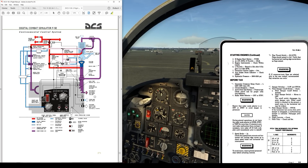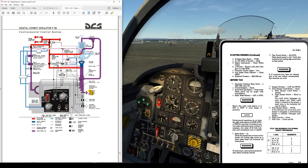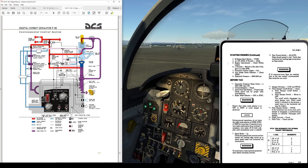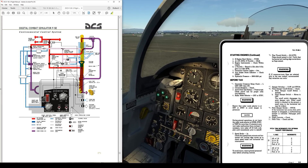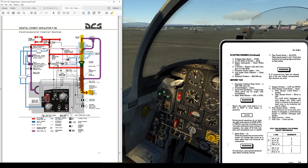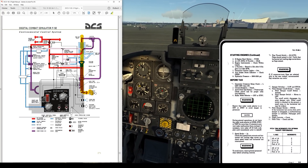This is a good opportunity to look at part of the ECS system. On the schematic we have electrical equipment and radar cooling. There's a ram air inlet up here - air would enter, go through a heat exchanger and get conditioned into cool air, then come down to cool the avionics and the radar. Since we're not actually getting that ram air due to not moving forward, we don't have any cooling going to the radar, so we need to leave it on no more than 10 minutes.